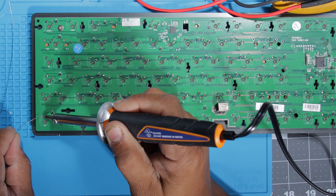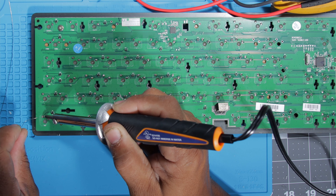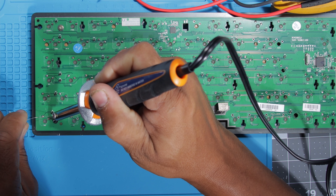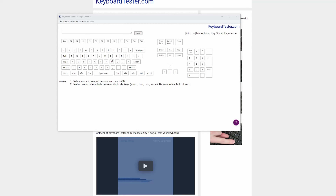Hope your iron's hot because it's time to go. Hold the tip of the iron between the pad and leg and add solder. Take your time. Once it's all soldered, reattach the cord if you chose to remove it. Now we want to plug into our computer and test all the switches before we completely reassemble it — this will make it tons easier if you have to redo any solder. This process is best with a second keyboard if you have one around, otherwise you'll be testing your skills typing with no legends, which can be quite challenging.